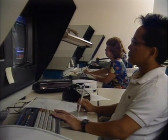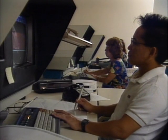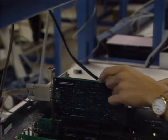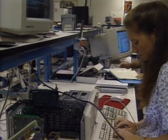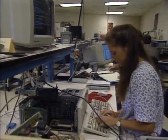For the engineers at Weitek, that suggested an obvious solution. With the standards that exist in VGA and Super VGA, the best approach for assuring acceleration and performance is to use a graphics processor to assist the main processor in the system. But moving graphics processing off the main system CPU was only going to solve part of the problem. The other bottleneck was the computer's bus. The initial VGA and Super VGA compatible parts were on an ISA bus, which allowed us to transfer data only in 16-bit bursts, if you will.